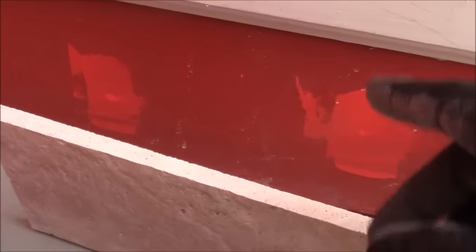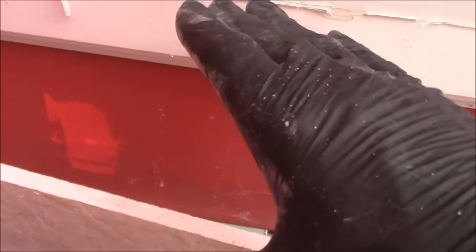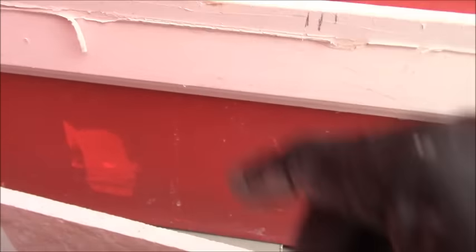Did I explain that right? Anything less than what your full tile is, if your tile is 12 inches, you go 11 3/4, 11 1/2, 11 inches, really doesn't matter. But obviously you want as full tile at the bottom row as possible when everything is said and done. So in this case, I'm going 11 3/4. I set all my tile that I possibly can on the ledger board.